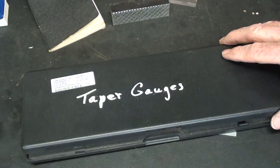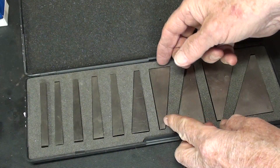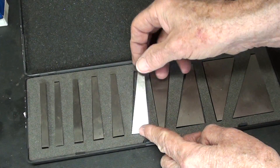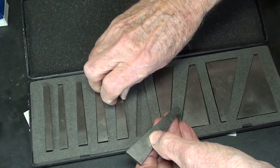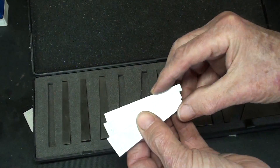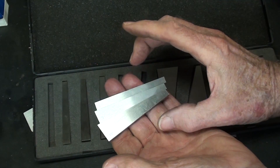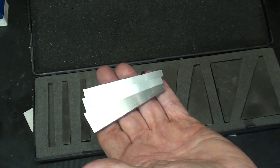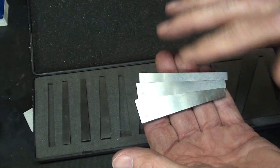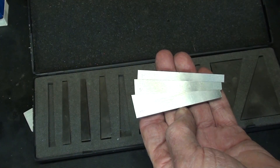I've often talked about taper gauges or taper blocks. The problem with this set is there is no 16 degrees, so you would have to take the 10, a 5, and a 1 — that gives you too high a dimension, but it would be a very accurate 16 degrees right there. And this could be used for making the 16-degree angle block that I'm going to show you right now.